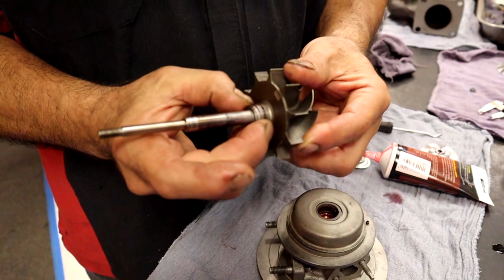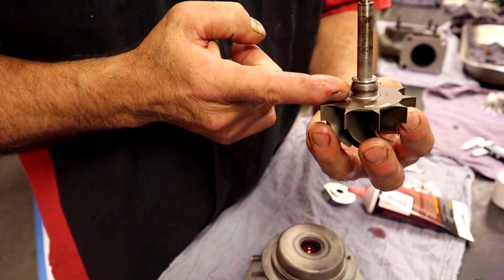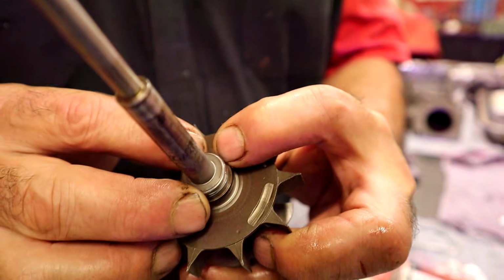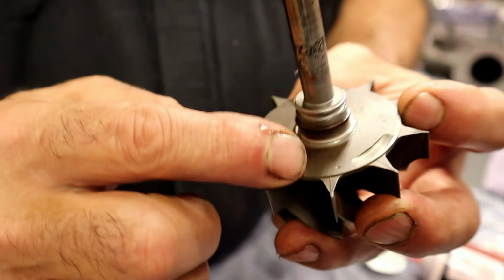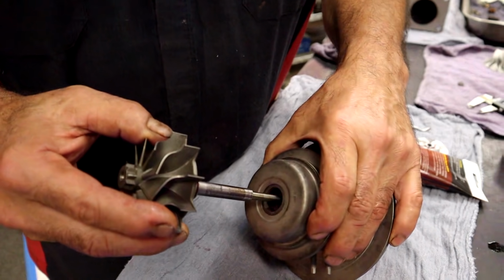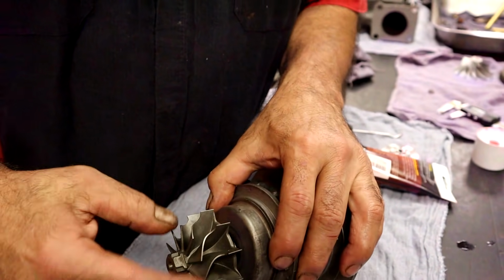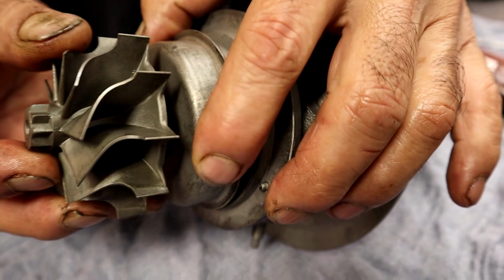Also do the same thing with the ring. I push the ring down and have the gap in, not out, because if it's out when you go to assemble it, you could actually bend the rings in while you're assembling it. So I like to push it down and have the big part up here and not the gap. This is going to go in just like this. A lot of times I'll even take the shield and use it to help push my ring down.